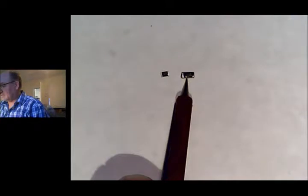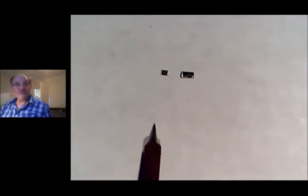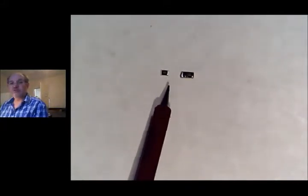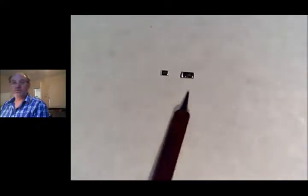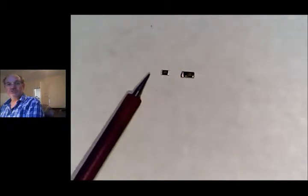There you go, we zoom down into the resistors. There's one, that's the original one, and I fitted it with three of those. Yes, I know it's smaller, less wattage. But there's three of them in parallel, so three 3-ohms in parallel gives you 1 ohm, and the wattage of the three of them will add up to be greater than the wattage of that one.